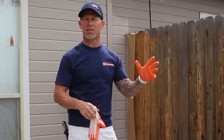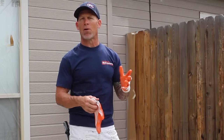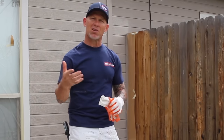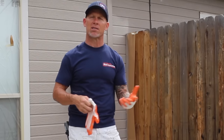Probably one of the biggest mistakes painters make is using their tips too long — to where they're actually blown out. Once you've been spraying long enough, you can tell when a tip is new or old by the sound it makes. When it starts to hiss really loud and you start to feel droplets coming down on you, you know that tip is actually worn out.